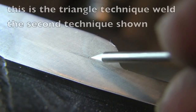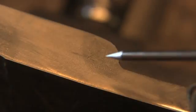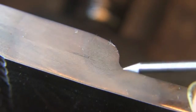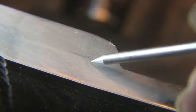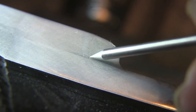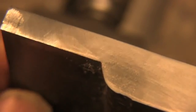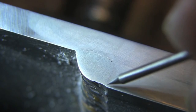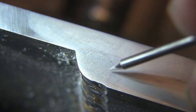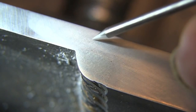These are not too bad and not too much difference between the two techniques, but there is a very tiny little dot of lack of fusion in the root of that one. You have to play the light on these things, otherwise you can make a mistake. This big area on the outside is the heat-affected zone, whereas this smaller area here is the actual fusion line. At 19 volts and 280 inches a minute, it was just barely hot enough to penetrate into that root — in this case, just barely missed it. On the other side, it did just a little bit better. Both welds have a good bit of convexity, but we'll measure that in a little while. There's going to be a line there because that's where two pieces meet, so if there was a little bit of a gap in the fit, you could mistake that for lack of fusion. But this is pretty typical of short circuit transfer — you don't have that deep finger penetration in the root that you would have on spray.